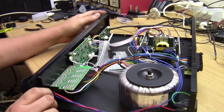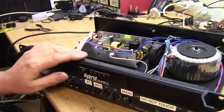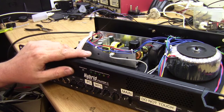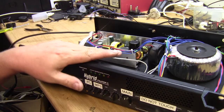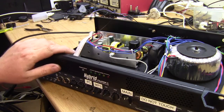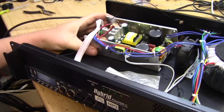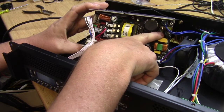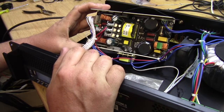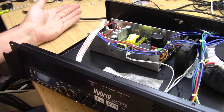This amplifier still looks in quite good condition because it's only a few months old. It was put in and then with the rainy season in December and January, moisture was coming down the walls and there was heavy condensation on this amplifier and it stopped working. I first opened it up after I received it, undid a lot of screws, and checked that the 5 amp onboard fuse was in order — and that fuse tested okay. So I plugged it in and it was dead. No power.